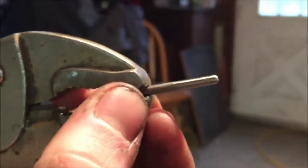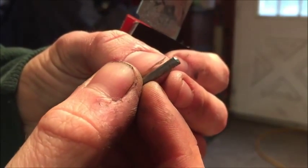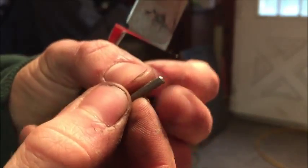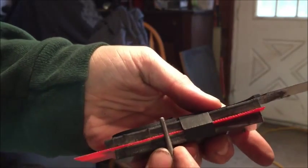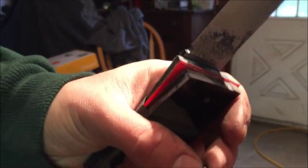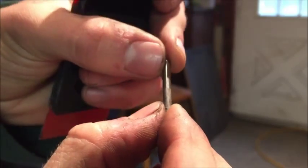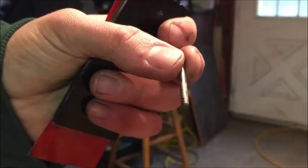The reason I leave it that long is because the ends on the vice grips bite into that pin. See that little bite right in there? We don't want that showing up on our final product. That's why I cut my pins a little bit extra long — so I have that room and I can shave that little piece off later, and then I have a smooth pin all the way around. Thanks for watching, guys.